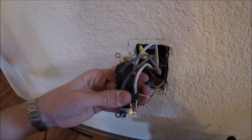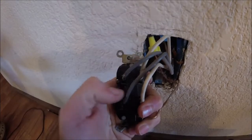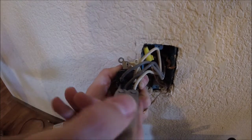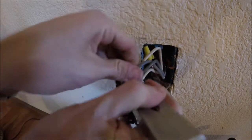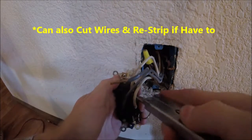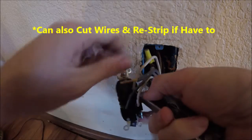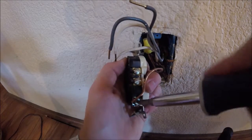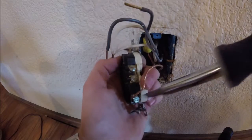If they're connected with side screws, just go ahead and unscrew those little screws and pull the wires out. But since they're in the push-to-connect fittings, get a small screwdriver — there are little holes right below where the wire is. Stick the pick in there and press in, and then you'll be able to pull each wire out. Do this on all the push-to-connect fittings. Then the last bare copper wire — that's our grounding wire — just unscrew it; it's looped around there.